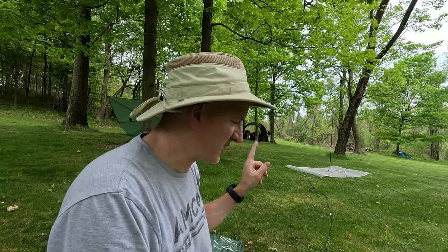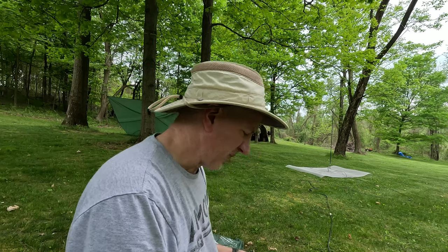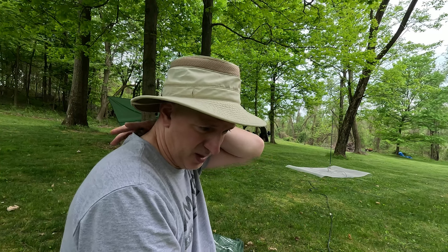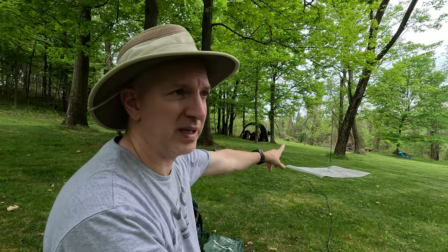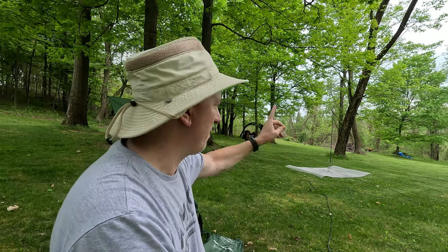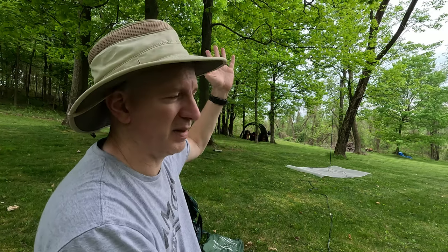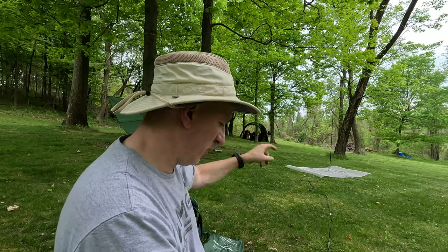The hamstick is set up. The best I can get on the hamstick is 1.7. I tried a couple of different things, but that is the best tune I can get on it with that as the ground plane. I know it's tuned better than that before with radials, but I haven't used the ground plane directly underneath it before. I did get it tuned lower when I just had the ground plane up near the driveway, but I think that affects it. And there are trees right above it — maybe that's affecting it a little bit — but it's 1.7.